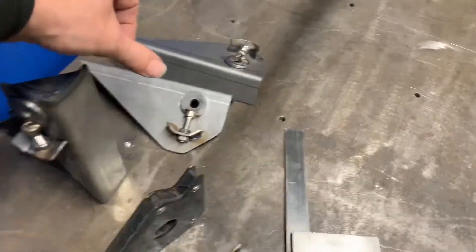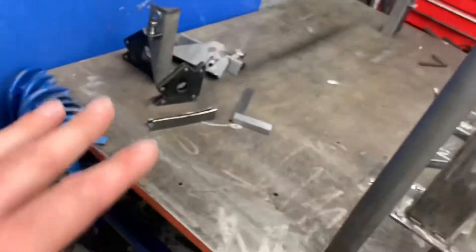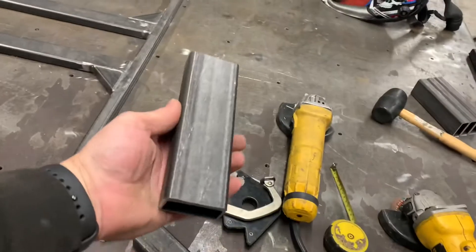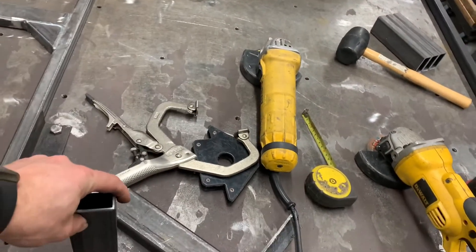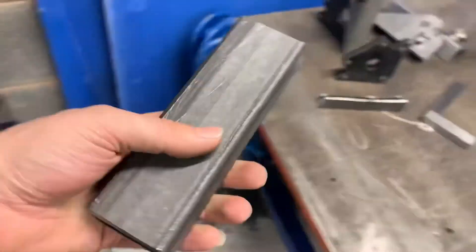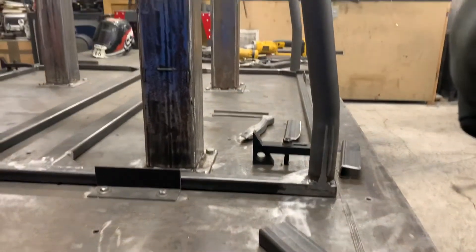These still aren't finished because I've still got gussets to put in the back, and this one has some holes to go in. But to actually get to your chassis you're going to need some 25 by 50, 3mm wall box section. This is what I use - you need four pieces of it. Now if you're working off my measurements for my arms, these boxes will just put you down here.